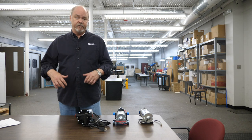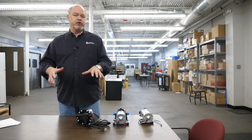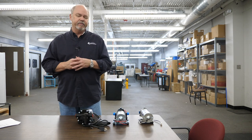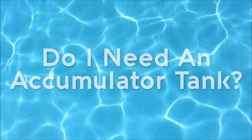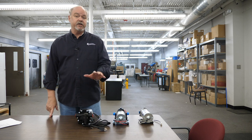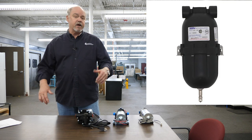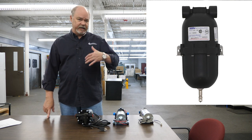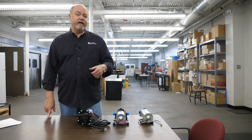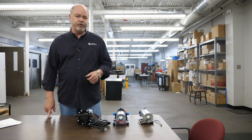If you're going to winterize the pump or take it out of service seasonally, just make sure you drain it and get all the water out — and it'll be fine. These pumps are designed to operate without an accumulator tank, but some applications benefit from a small accumulator to help the pump keep up and reduce on/off cycling, which will extend the pump's longevity.